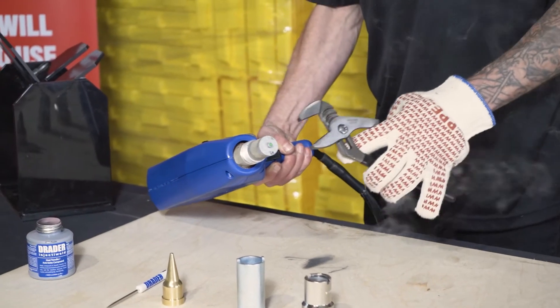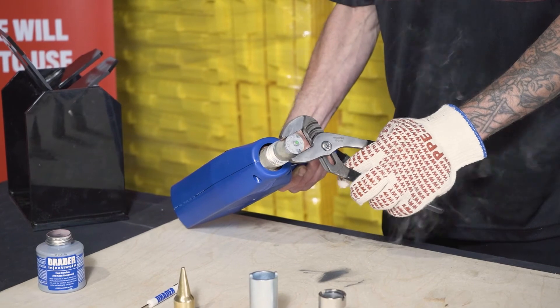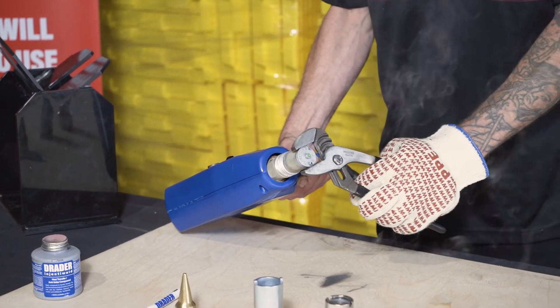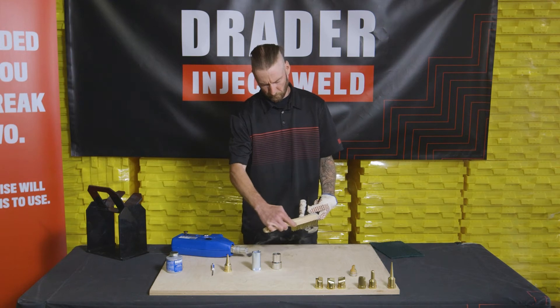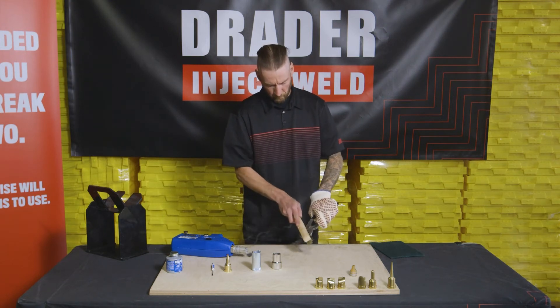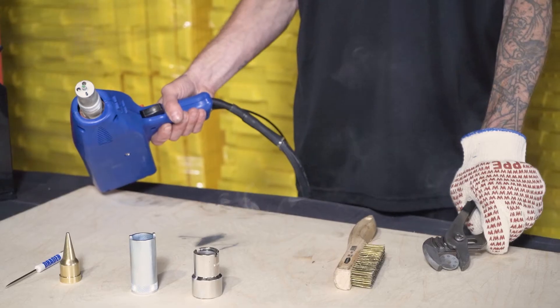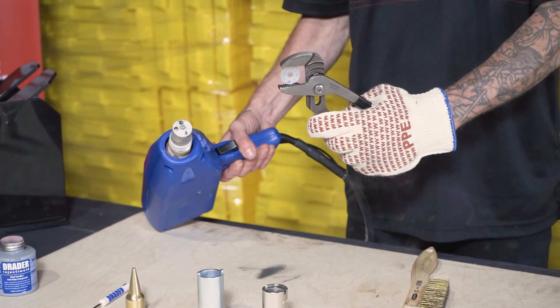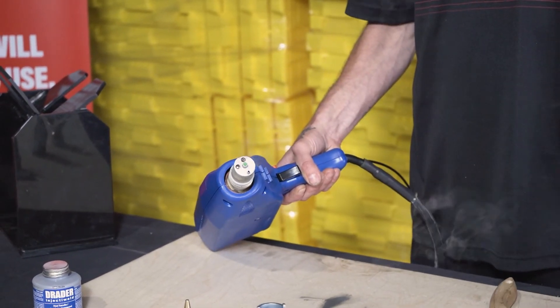What's important about the barrel washer is it has a little locating pin, and we want to make sure that locating pin is always there during a tip change. You'll notice that on the end of the barrel there's a locating pin — that locating pin matches up with the hole in the barrel washer. It's very critical that it gets matched up each time.